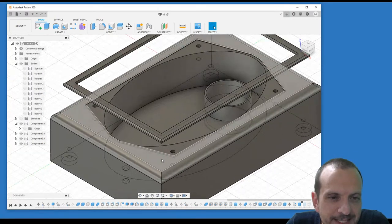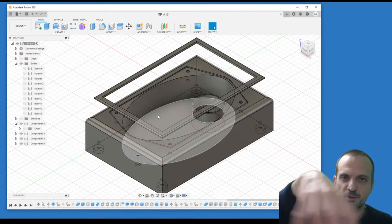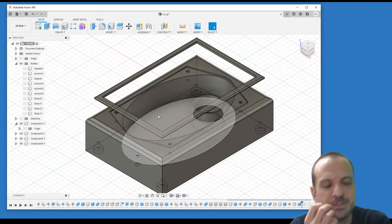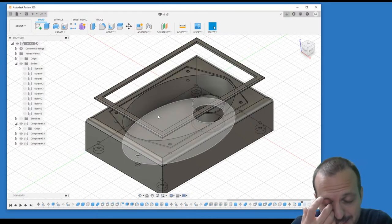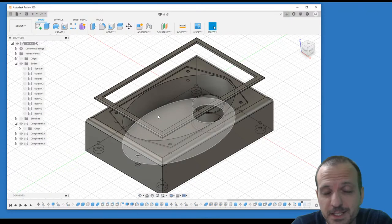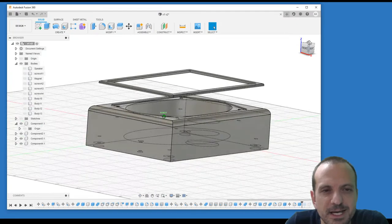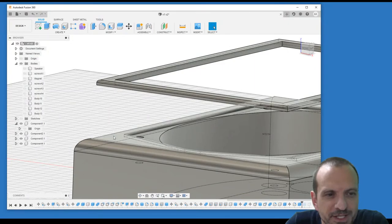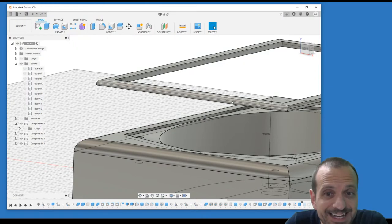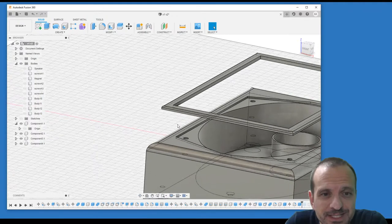And what you could do technically, if you imagine you're printing using additive manufacturing, you have to squirt the juice out from the bottom and you're bringing your juice all the way up to the top. You sometimes use a slicer program to add that support material for you, and it always gets it wrong and it's a bit horrible. But technically you could bring this in as a model. You could fit this so that the bezel is hovering just above that, and you're actually adding your own support in the CAM or even in your CAD. So you could print it as a one-off thing, and then you just slide a Stanley knife down it and it would release.